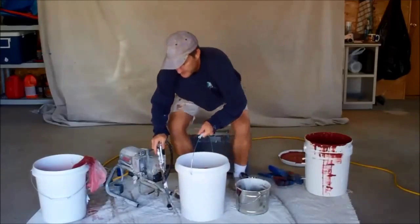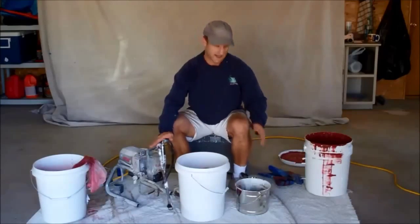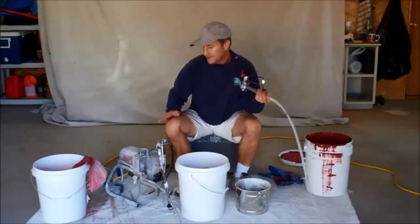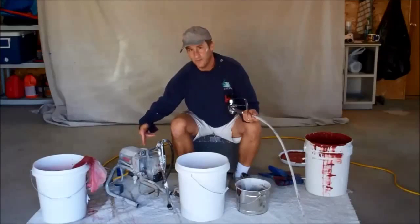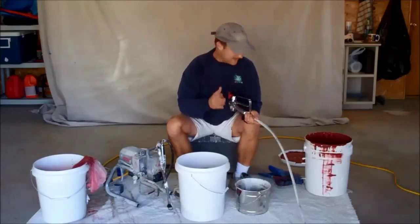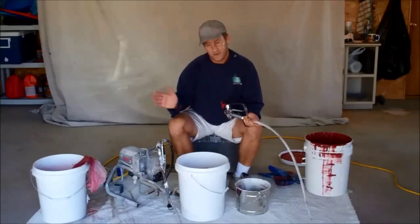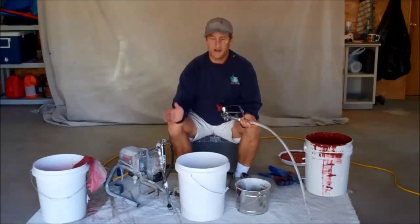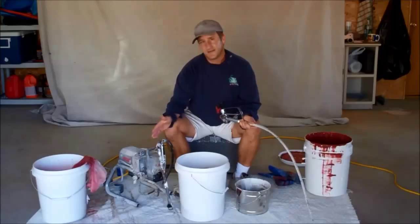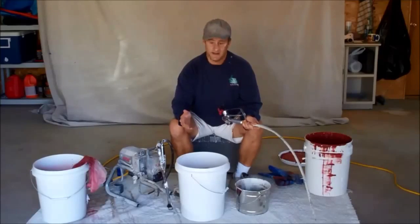Move the paint bucket over in front of the sprayer. Right now I've got water in the pump and in the line from the last time I used it. What I'm going to do is first prime paint through the pump, then cycle paint through the line, then install my tip housing and tip, and then I'll be ready to go — it's really that simple. Note: a lot of times paint sprayers are stored with paint thinner in the line; if that's the case, cycle clean water through the machine before using latex paint.